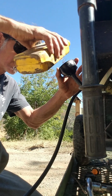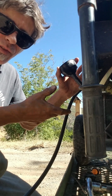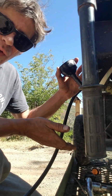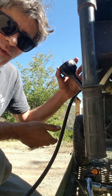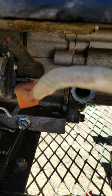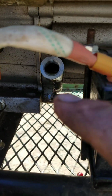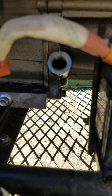So on that wise, you might want to actually keep the oil pan under there, even though you've already changed the oil, and probably pull it out of the way. When you do that, you probably want to put it underneath there so that it'll maybe catch any excess, and get it on your surface there. Okay, there's the oil fill. You can see a little dripping out there. Like I said, that little neck is tipped back at like a 40-degree angle, so it will actually retain oil, see.